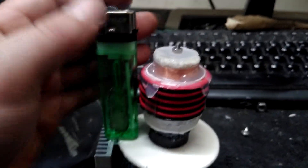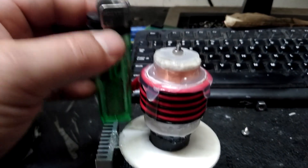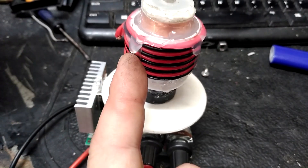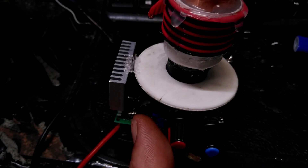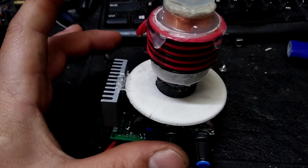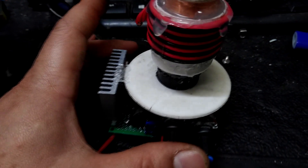So that's basically the scale. What would be more ideal is a coil more the size of this lighter. I'm probably eventually going to go back to using IRFP250s for this circuit — throw a little bigger heat sink, basically design it with the heat sink as a sort of counterpoise. It'll be a large flat heat sink that you can lay the FETs on, and scale the coil up just slightly.